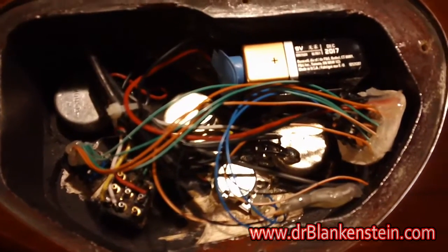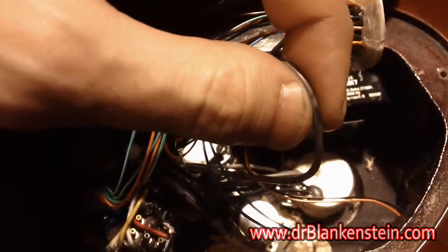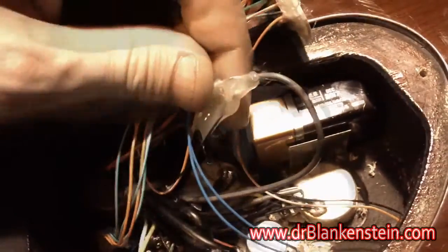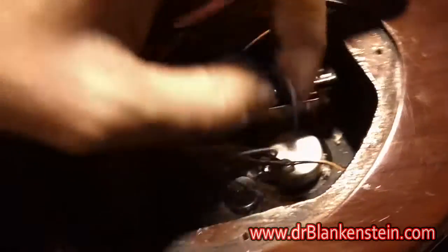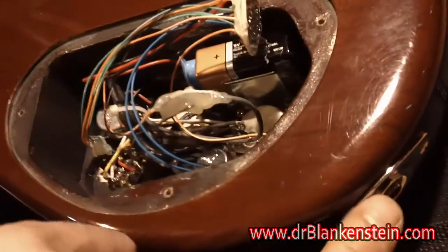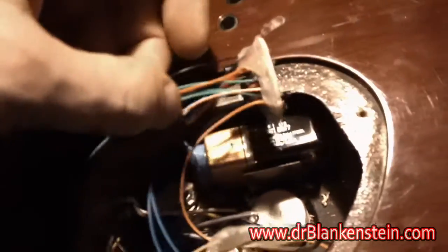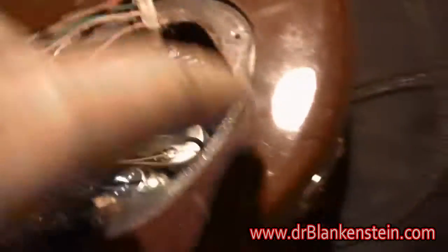The other pull of the switch switches from your true bypass natural guitar tone to running it through the Allumeringer mod. I'm going to walk you through the installation of the mod — it's very simple, just a few steps. This gray wire was the output wire going to the output jack of the guitar; it has the signal and the ground wires — two wires in this one wire. Your guitar might have one wire with two wires coming out of it, or it might actually be two separate wires. Either way, one will be a signal wire and one will be a ground wire — the ground wire is usually black. You take the output wire which was connected to the output jack, desolder that, and you'll have two wires. Then you take the input wires — labeled on the mod — and solder those to the output of the guitar. Now we have the output plugged into the input of the mod. Then we take the output of the mod and solder that to the output jack of the guitar. And we're done.